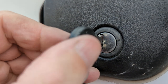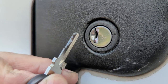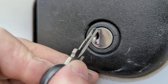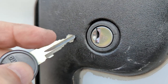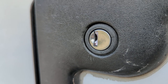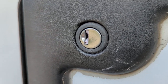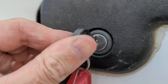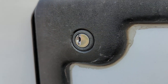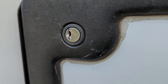That shoulder is hitting on that plastic tab. So what I did, I got a utility knife and at the top and the bottom, I've cut a little 45-degree slope. Now when that shoulder hits it, it can push the plastic shutter back and help it work. Just a bit of a tip for if anybody else is having trouble getting their locks to work. The other one I pulled out works perfectly fine, so now I've just got to work out how it all goes back together again.